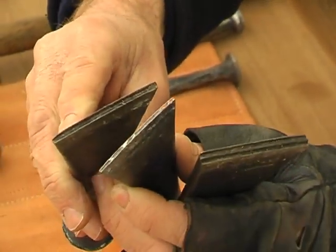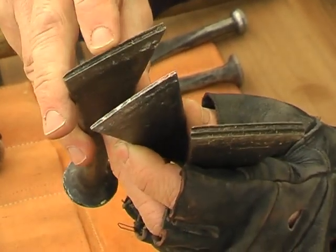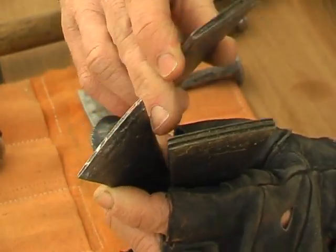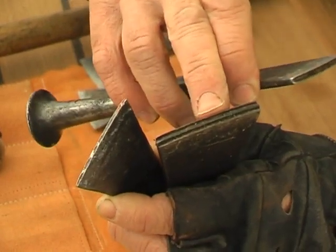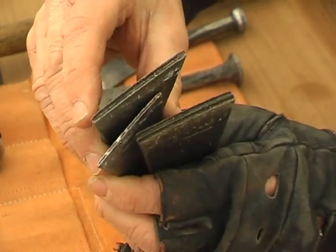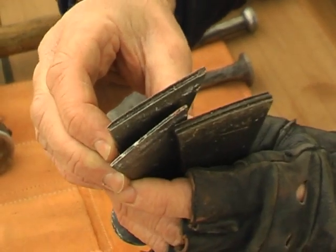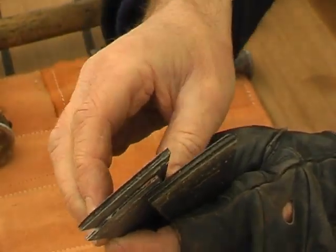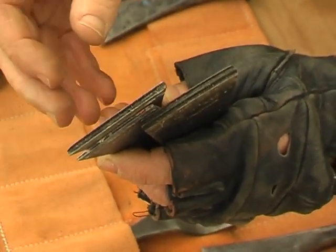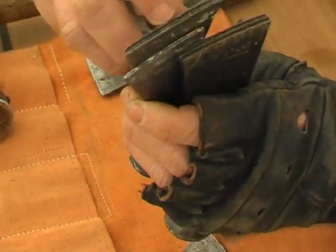You can see that when I say the crease in the iron, it's actually like a V in the end of the iron, and they vary in width — the little thin one, a thicker one, and then if the seam gets very big you go to a bigger one which is like a double crease. The reason they're like this — I call it like making a bed. When you actually fold a sheet under the mattress, when you're putting the oakum in, it actually folds it into the seam, pinches it on either side, and that's what the actual crease does.